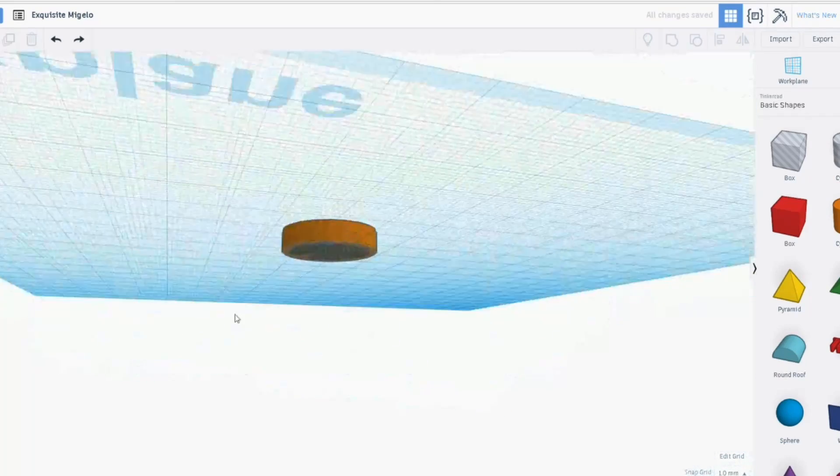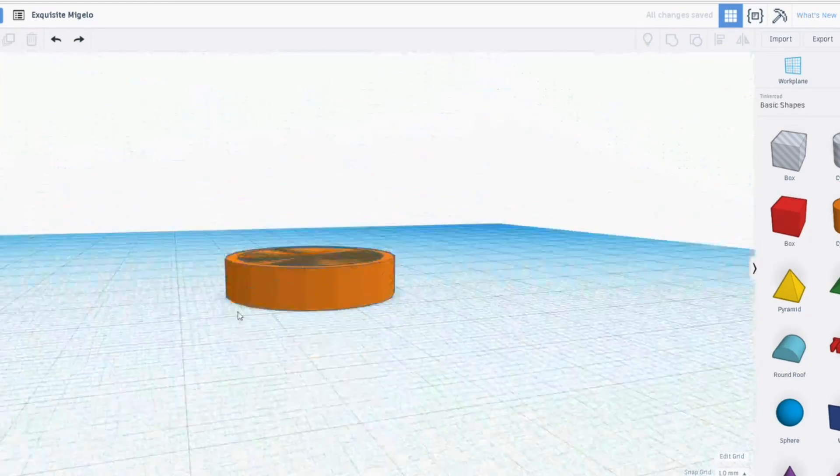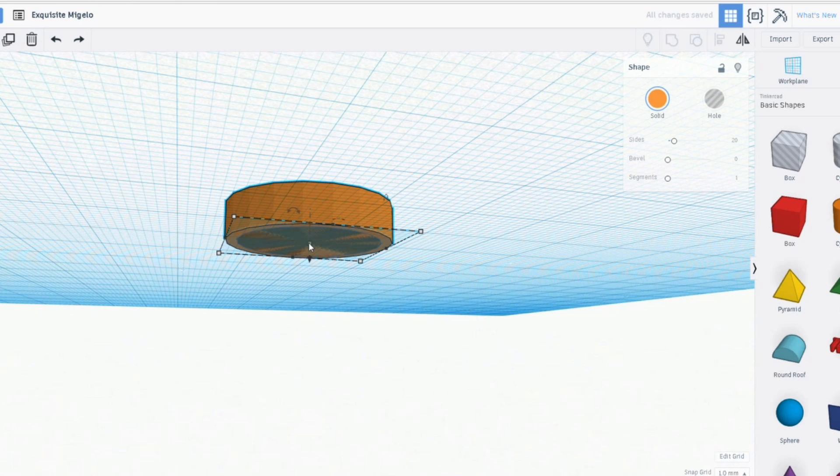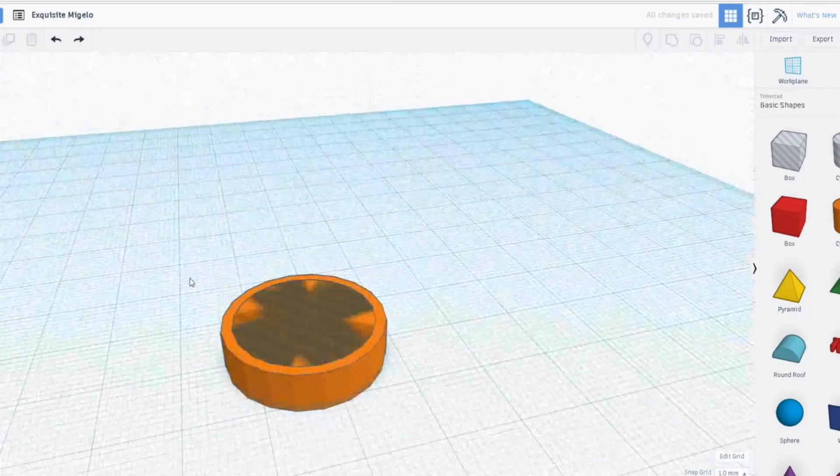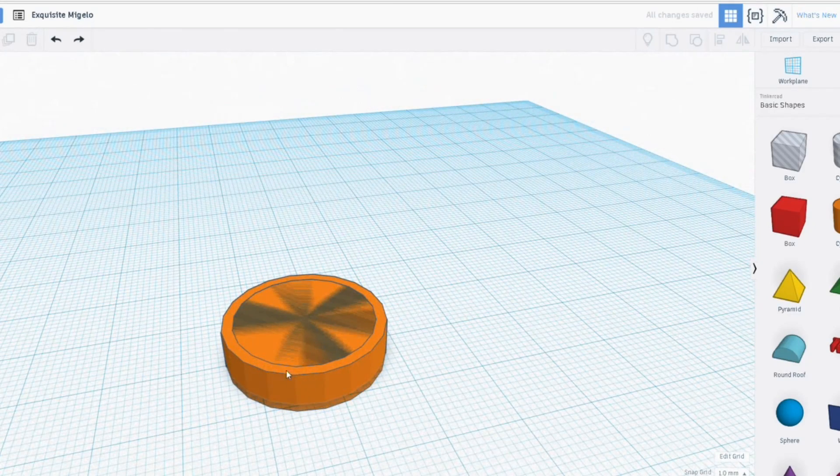Now the end of my cap here, I want it to be about a millimetre thick. The 3D printer will sometimes not like to print small things because of thermal runaway. What I find is actually if you print two things at the same time that will help. Some people use other software to set time delays between each layer, or you can use a fan, but if you're just running a standard printer we will print two at once.